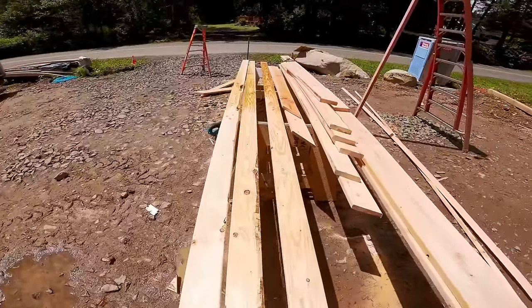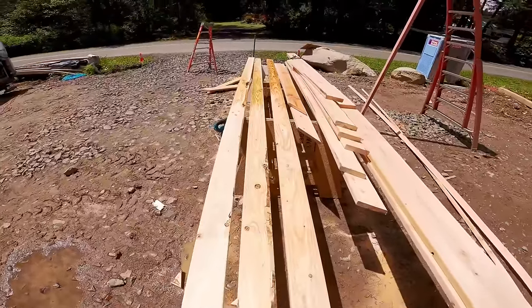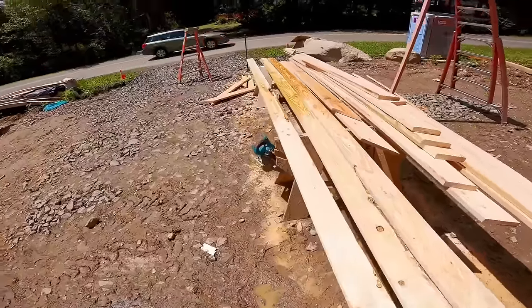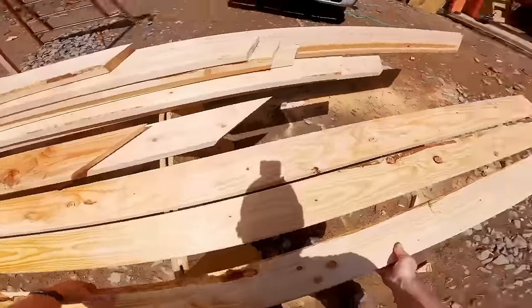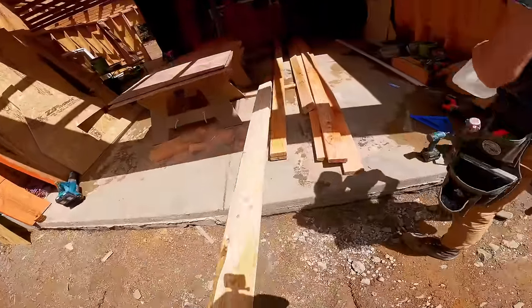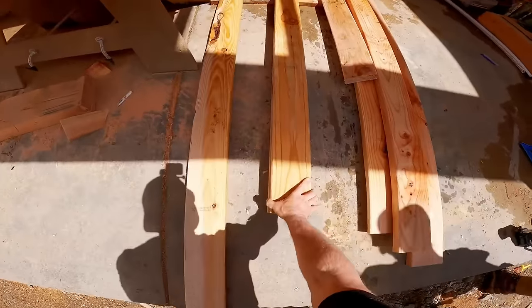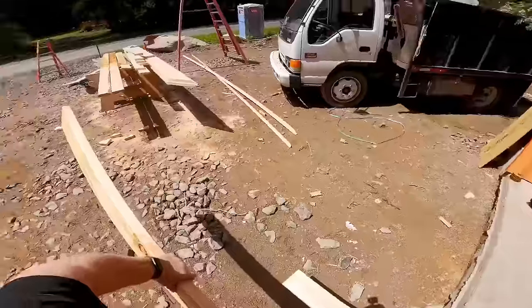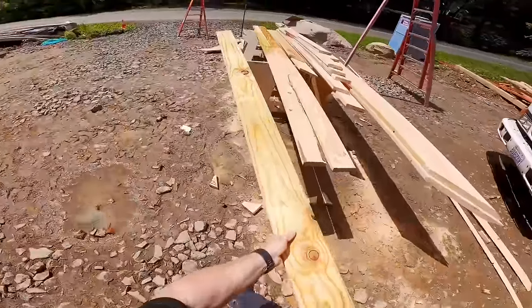Then I take all of those boards and I stack them longest to shortest, and that's one side of the roof. In this case, I needed three more, so I grabbed some, I think, 20s or 16s out of the garage. And it's going to look like there's a ton of waste here because I'm only going to cut my three smallest jacks. Then the remaining scrap, I just flip over, and I already have the opposite side sharp and